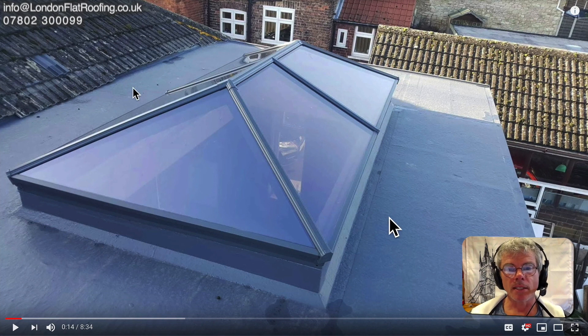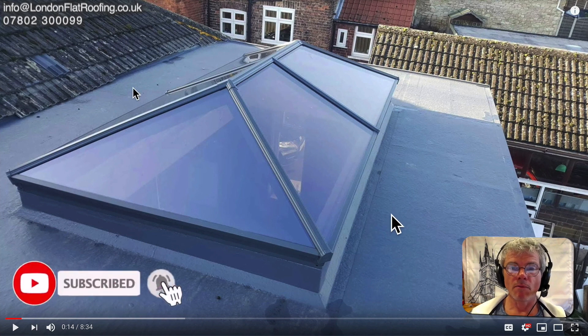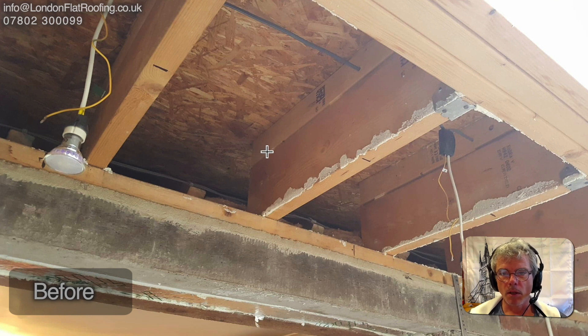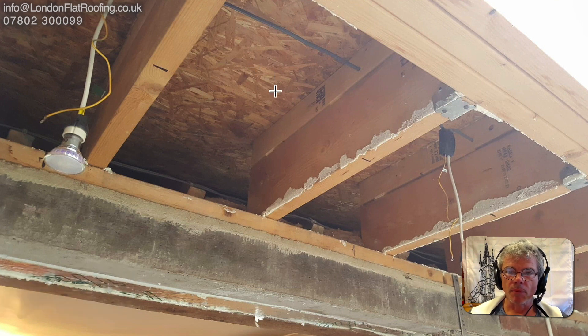You'll see how we manipulated changes to the existing roof structure, using as many parts of it as we could to keep the cost down, vent the roof, and form a good cold roof. Let's look at some before and after photos — this customer up north has sent all these through and it's been really helpful for a lot of people. Behind the big skylight here you can see he's taken out all the insulation, exposed everything and cleaned it all down. We talked about making through-ventilation going across this way and cutting holes.